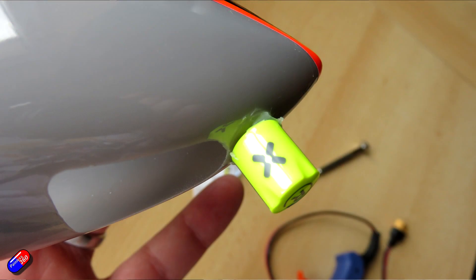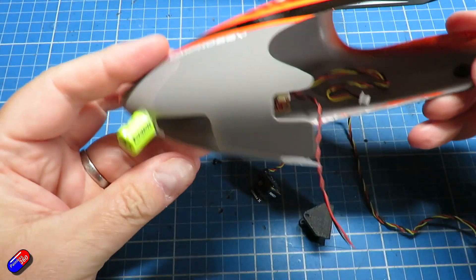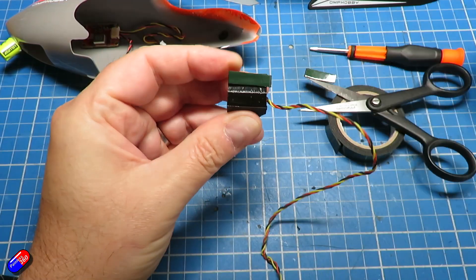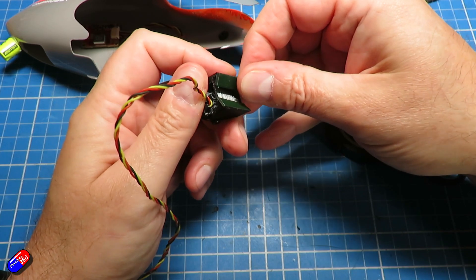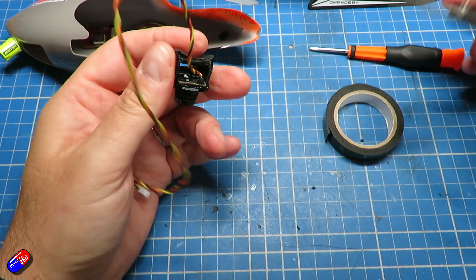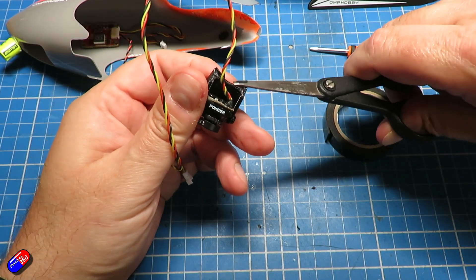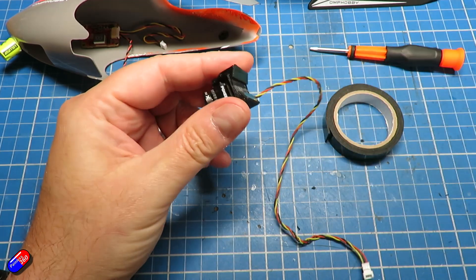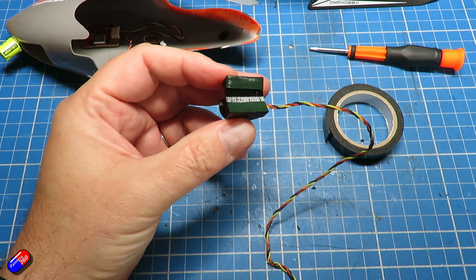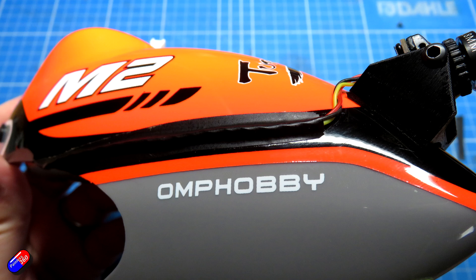With the antenna in place, I used some double-sided foam tape to attach the video transmitter on the inside of the canopy. To mount the camera at the front, I designed and 3D printed a bracket that matched the shape of the nose and allows me to pop it on there with some more double-sided foam. The next question was how to run the cable from the camera back into the canopy. Rather than drilling another hole, I decided to run it outside the canopy using a trick of covering it with black insulation tape — that holds it in place, protects it, and blends it in so you can't really see it unless you're looking for it.